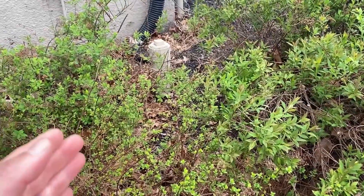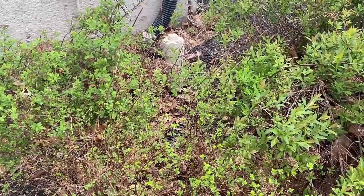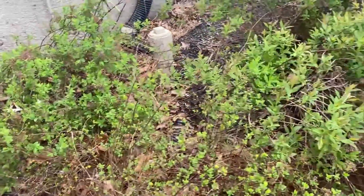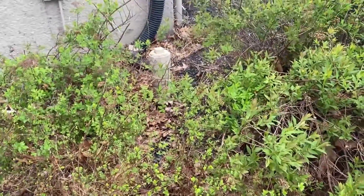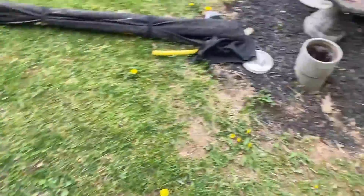There may come a time where you actually have to get in there, run the auger, and dislodge whatever gets stuck. Best practice is to avoid flushing things that could get stuck — namely flushable wipes, feminine products, condoms, cigarette butts, even a rubber duck. That stuff can get down a toilet and cause problems in your sewer pipe. This sewer pipe is made of PVC so it's fairly smooth with not much buildup, which looks pretty good.